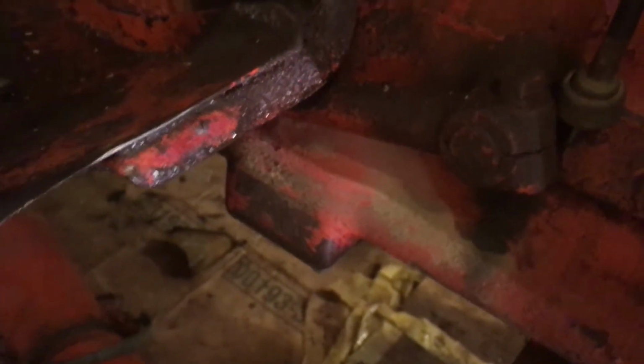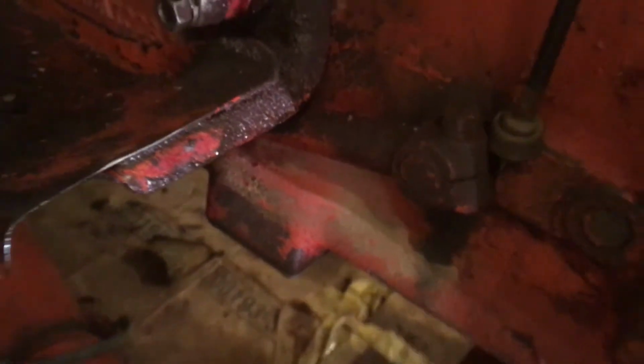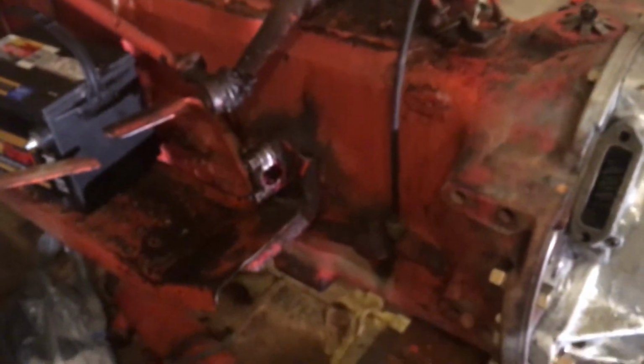And this plate is not completely blocked. It has 5 holes: 4 holes for the screws to mount it, and the middle hole simply needs to be open, so if there's oil accumulation, it drains out on its own. I should be able to see any oil dripping from there, so it should be open. I believe it gets blocked because it's a tiny hole and it's open. While you are using the tractor, any dirt can fill up this cavity. What I found was very thick dirt.